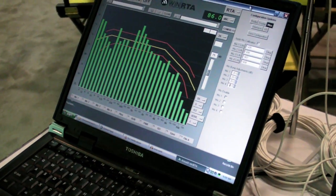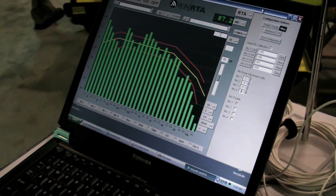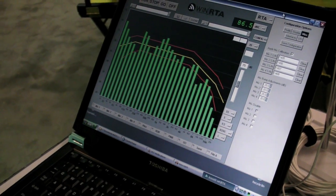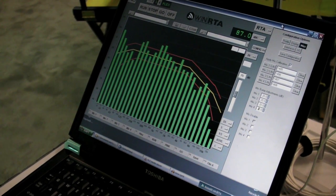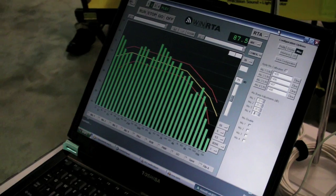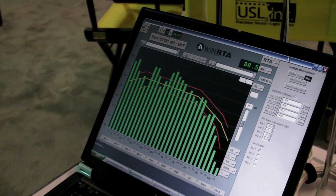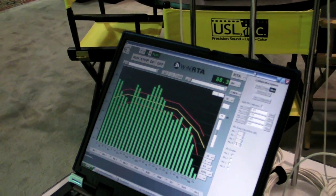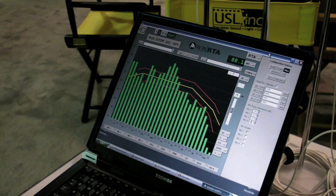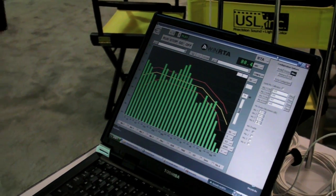Now on the screen here, we currently have some ambient noise, so it's giving us basically not the sort of thing you would see when you're doing a calibration in a cinema. But this screen will help you understand that the levels across the range should come within those red, yellow and red lines. The lines represent the X-curve, which is a cinema-standardised way of tuning a room so that in a larger room versus a smaller room the sound will be subjectively the same. And that's the whole principle behind it.